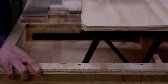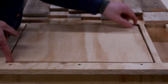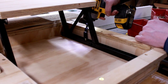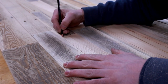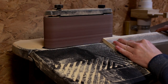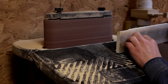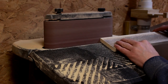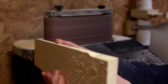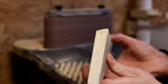I then attached the door to the desktop. This was a little bit of trial and error until I got a nice fit. I had some awkward angles while mounting the hinges to the desk, and this ball and socket drill bit really came in handy. Next I needed to make a bevel on all the edges of the door that may contact the desktop when opening and closing — if I skip this step I would have a really hard time opening the door once everything is glued up. Using an oscillating belt sander came in real handy for this, though any type of sander will work. I put about a 25 degree bevel on all the edges and also beveled the end of the board to help with closing the door.